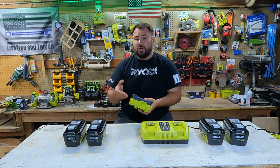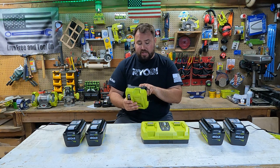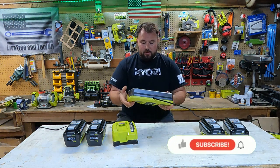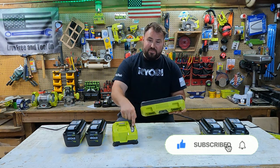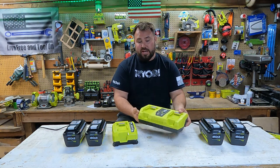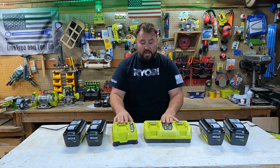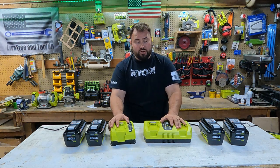It's really important to know what the actual wattage is for the charge on these. The single rapid charger charges at 295 watts — that's 120 volts at 60 hertz in America. The dual charger is supposed to charge both batteries at the same time, just as fast as the single, and it runs at 590 watts at 120 volts, 60 hertz. It literally looks like they split the power supply and you get the same charging capacity for each slot.